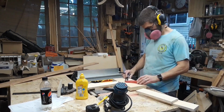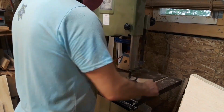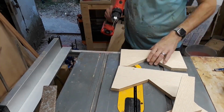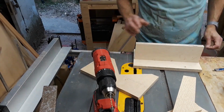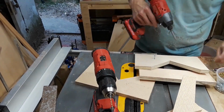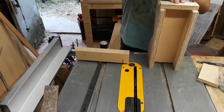And the reason the sled was special is just because those angles kind of fall away from one another, and you gotta cut one side of the sled at a slightly different angle than the other side of the sled in order to just kind of keep it working relatively straight to itself. And I also know a lot of people are not fans of splines, but I actually happen to like the look of them and try to include them in any project where possible.